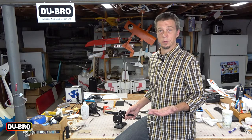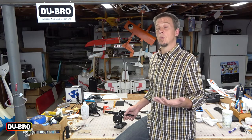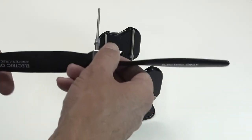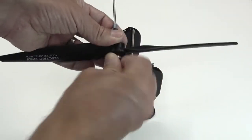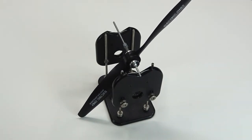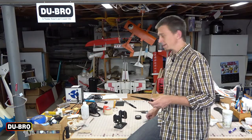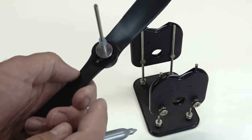Your results can be influenced by small air currents in the room — those may come from air conditioning vents, a ceiling fan, or even your own breathing — so be aware of that and manage things the best you can. Once you've got the shaft on the rollers, hold the propeller horizontal and gently release it. We can see that one blade dips down. I like to spin the aluminum cones on the hub just to reseat things and give it one more shot. We definitely have a heavy blade here, and I like to mark it with a small dot on the back of the hub. For a black propeller I'll use a silver sharpie; for a gray propeller a black sharpie works well. As long as you can see the mark, it doesn't matter what color you use.